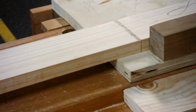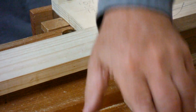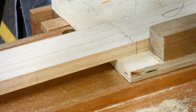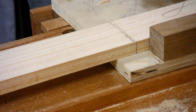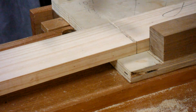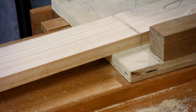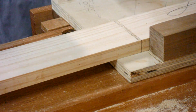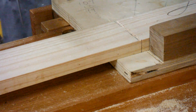10 minutes. Okay, so now we want to saw it. When you're sawing it, just move that piece of wood aside, because we're going to make a joint out of this. We're going to make a rebate joint on the end of the piece of timber. You're all going to get a stick this size. You're going to mark it out the way I've shown you. Chop, chop, chop. Then we'll start to cut the joint on it. We'll only get as far as cutting it out today.